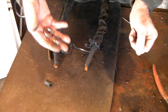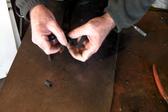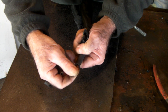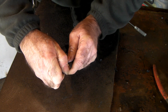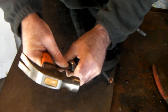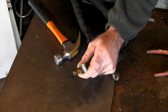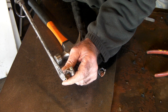I'm just going to use this - it conducts electricity and it's not plastic, so it's as good as any. Before we splice it guys, get a couple of hose clips like that - make sure you put them on before you start because it's a pain trying to put them on after. Get whatever you're going to splice it with, pull out the cable and spread it out a little bit, then push whatever you're splicing with in next to it like that. Just grab a hammer and tap it in. There's enough room to put my hose clip on, so put your hose clip on and do up the hose clip - make sure it's tight and squashing the wire down onto the metal splice.